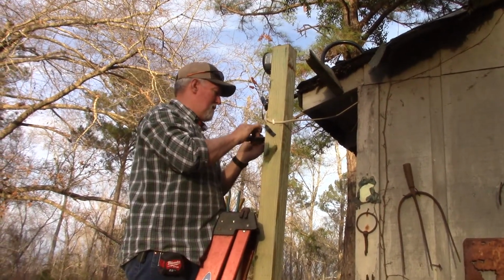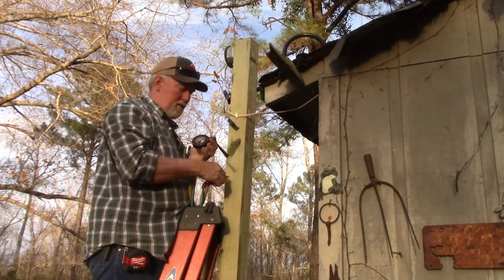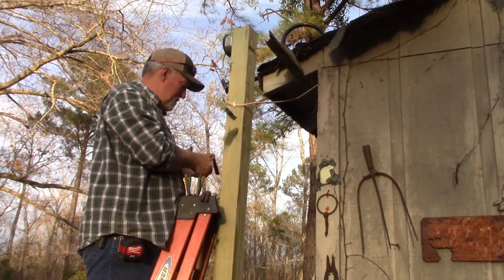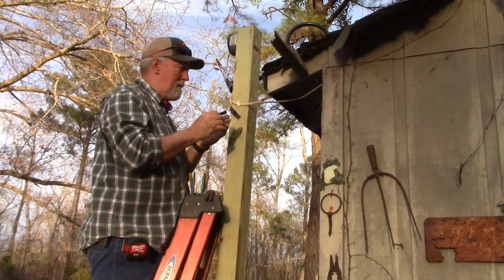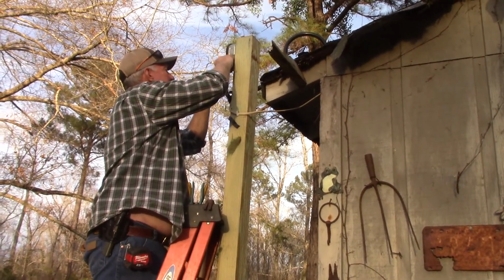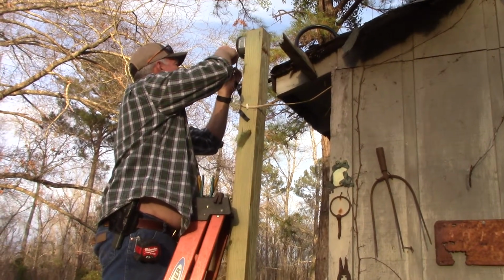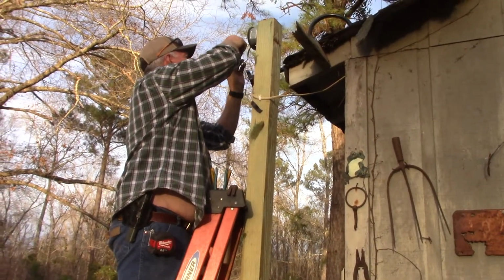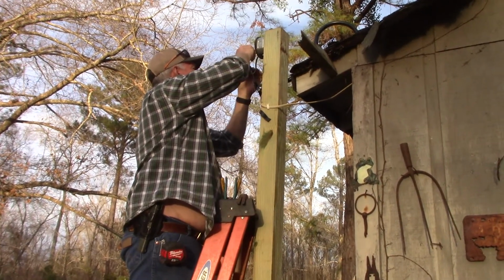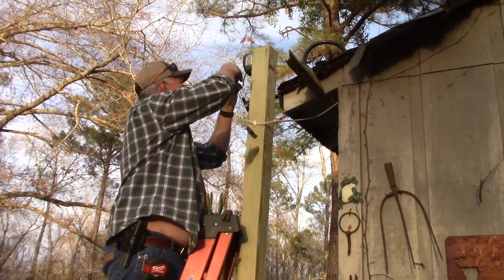And sometimes you can look in an old light switch or an old receptacle and you'll see the wires have started backing off. People wonder how they got loose. Well, that's how. It's constantly in and out, back and forth. And sometimes it can do it real bad and actually cause a fire to start in an old house. So ain't a bad idea every now and then, when you ain't got nothing to do on a rainy day, check your light switches. Have an electrician come out.